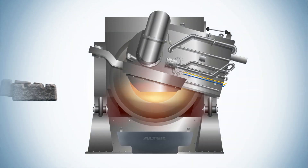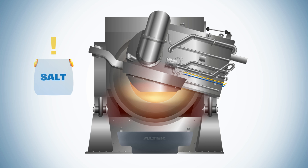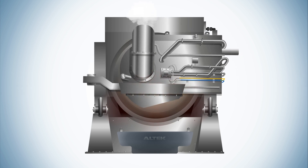The recovered aluminium is recycled back into the furnace. The remaining compacted dross, once cooled, can be easily stored, ready to be put into Altec's tilting rotary furnace, where salt flux — a crucial ingredient in the separation and recovery process — is also added for operational safety and to maximize further aluminium recovery.